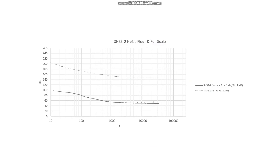So let's look at the first curve. Each hydrophone you can program in four settings, which we call -1, -2, -S1, and -S2. The -1 and -2 have a relatively flat frequency response after a certain frequency, about 1000 Hertz. And then the -S1 and -S2 are with a sloped response, which has certain advantages that we'll go over.